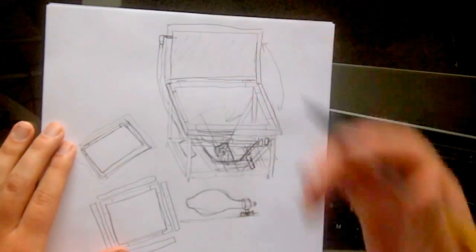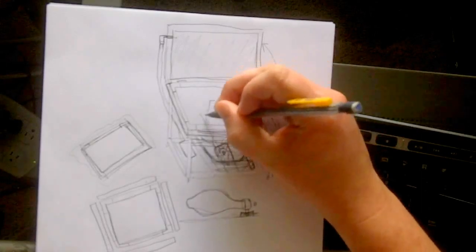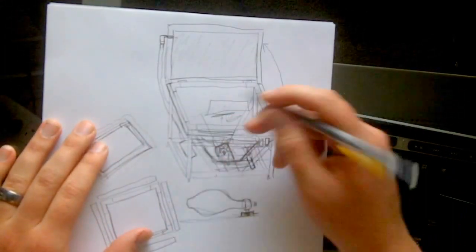And the idea is that when you burn a screen, you want your film to act as a creating a shadow on your screen, so you don't want light bouncing everywhere. So when I see exposure units that are built white on the inside, or are all reflective on the inside, that's kind of defeating the purpose of building this unit with a very bright metal halide source.